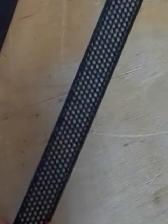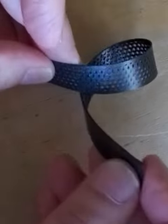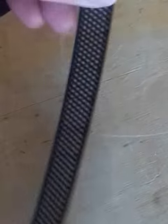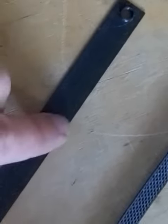I also tried printing this part with honeycomb infill at 40%, and this result is interesting. It's actually very flexible — you can bend it a lot — but all in all it's a bit too wobbly. If you made it a bit thicker, perhaps it would have even better properties than the part printed with 100% infill.